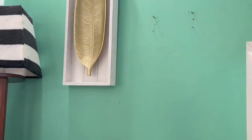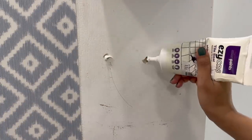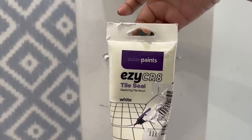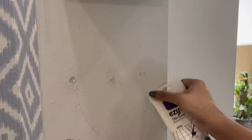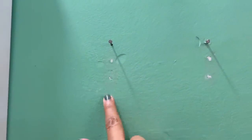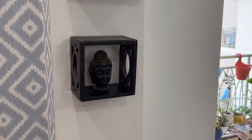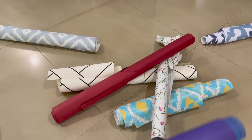This putty can also be used on walls — if you have any nail marks, use it to fill those holes. A hack I just discovered while shooting: the back side of this tube is flat, which can actually work as a putty scraper. When you apply the putty on the hole, just use the flat end to scrape the excess and level it with the wall — you don't need an extra putty scraper and your hands don't get dirty. These are really small things we procrastinate on, thinking we need to make a paste of plaster of Paris and create a mess, but this small tube can do the job perfectly in just a few minutes.